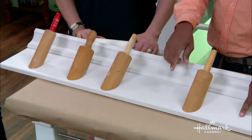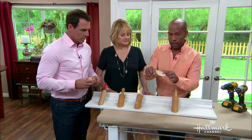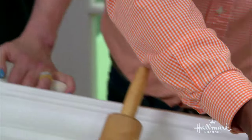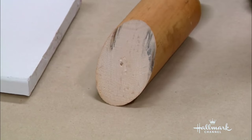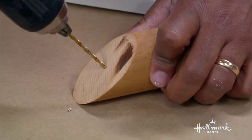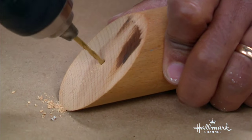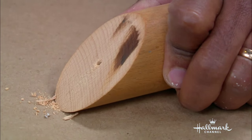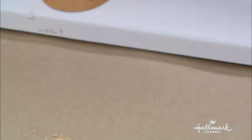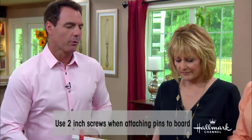What I did was measure every six inches and drill a little pilot hole through the back piece, and then a tiny little hole in each rolling pin half. A pilot hole is a small hole you drill first — since the wood is really compact, driving a screw straight in could split it. So you remove just a little of the wood so the screw slides in cleanly. It's a starter hole for the screw.